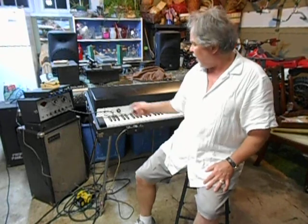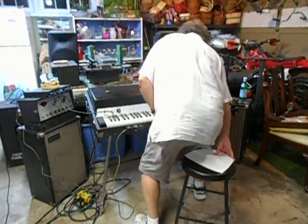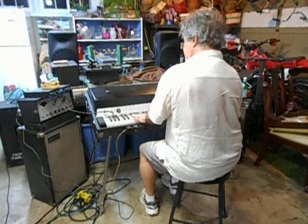The volume knobs, the wiring harness that came from Vintage Vibe, broke, so I bought a new old stock pot. It's a 15K. I bought 2 of these from the Rhodes Scholar off of eBay, and I put it in because you need volume control, because this 72 now is putting out an enormous amount of sound off of the harp now that the electronics have gotten all cleaned up and it's grounded. An enormous amount of powerful sound, so you need a volume knob to be able to pull that down. So here's my Leslie preamp, and this is what the piano finally is sounding like. And I gotta pull the volume way back because it overdrives the camera.